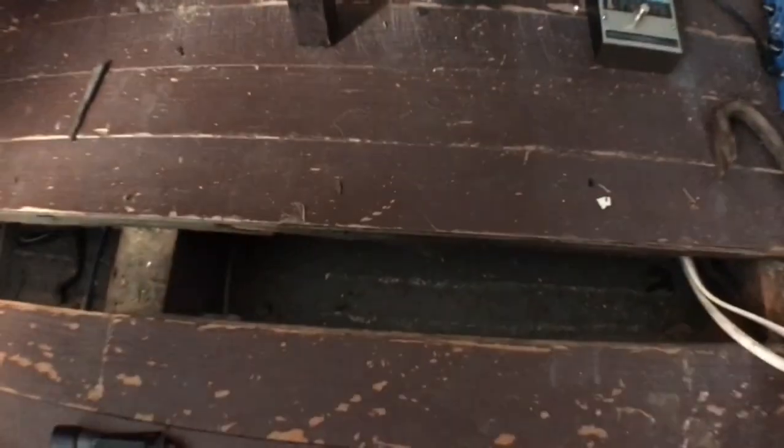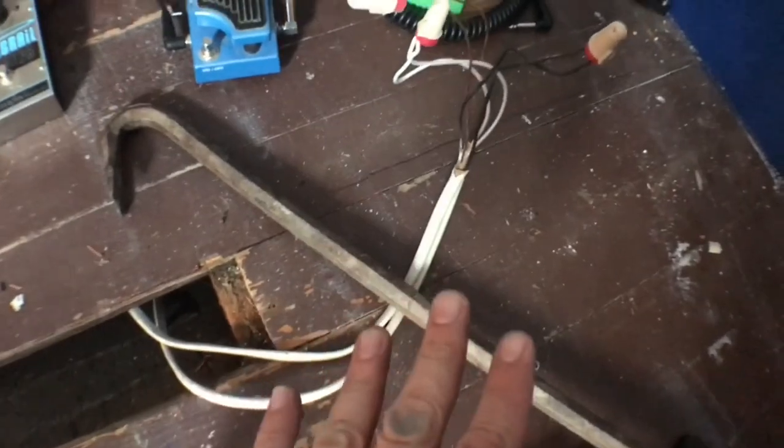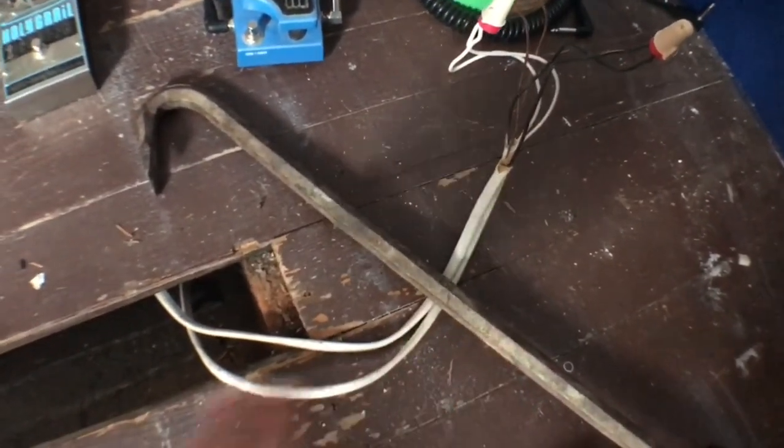I'm working from the top down. I came into my attic and identified where I need to make my hole larger. I pulled up one of the floorboards and you can see the daylight — that's the spot I'm going to be enlarging. I've pulled all my electrical off to the side, and I'm going to go down to the basement and turn that off at the box. Make sure you shut off the power — that is important when working with electricity.